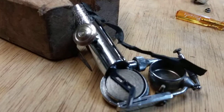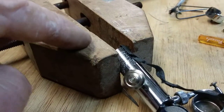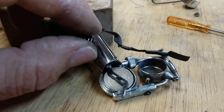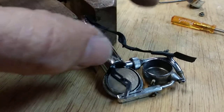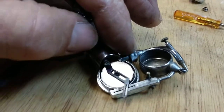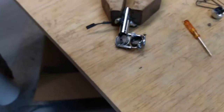Oh my God. It only took about five minutes that time. What I did is I put a Jorgensen clamp holding the end up so I can keep this kind of stationary, not flopping around. And then I slid it underneath there with the trigger pulled back with a bread tie I looped around there — that holds the screw out so you can get to it. And I got that back on. After half an hour of doing that, you learn how to get that in there.